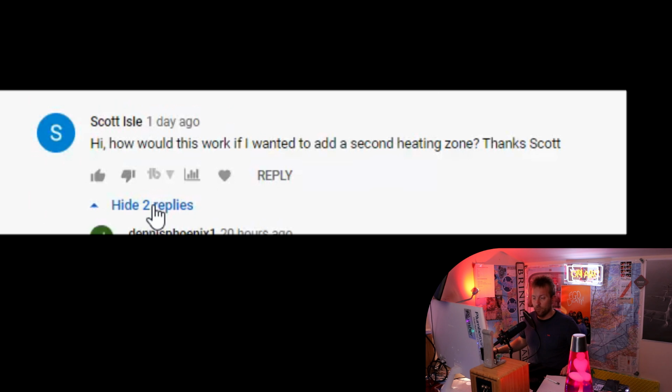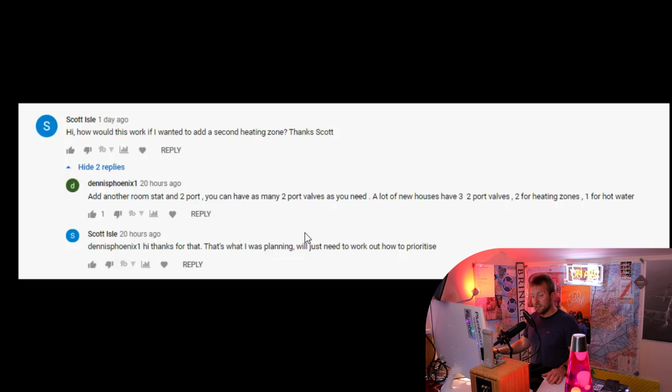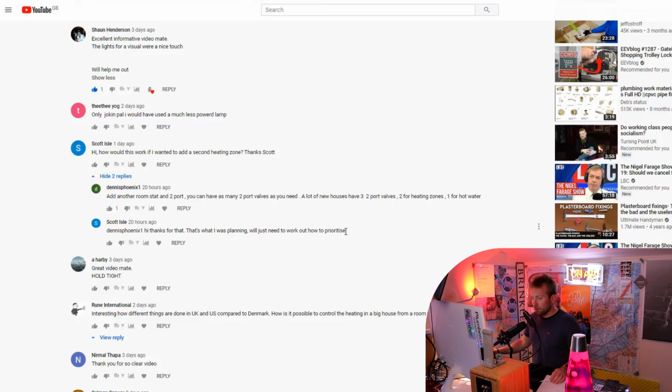Oh, mate, what a great question. That's what's good about S-Plan systems. So, Dennis has gone in there again. Dennis, you're a bloody hero, mate. Add another room stat and two-port. You can have as many two-port valves as you need. A lot of new houses have three two-port valves: two for heating zones, one for hot water. Hi, thanks for that. That's what I was planning. I just need to work out how to prioritise.